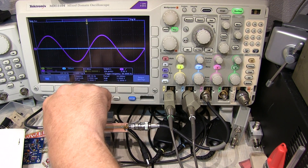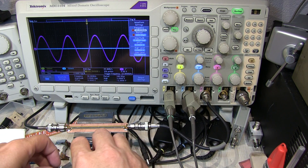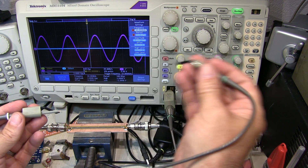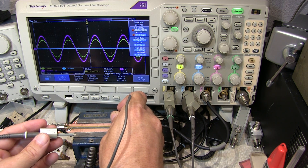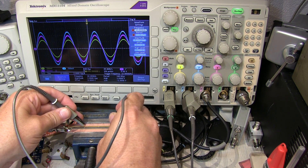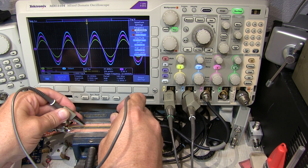Let's take the waveform frequency from 100 hertz to 10 kilohertz — still a pretty low frequency signal, certainly within the audio range. Remember, both probes read about the same at 100 hertz. Now at 10 kilohertz, the probe on channel 1 shows an amplitude quite a bit lower than the input signal on channel 3. And the probe on channel 2 shows an amplitude quite a bit higher than the channel 3 waveform. So these two probes, which both measured proper amplitude at 100 hertz, are reading quite different at just 10 kilohertz.